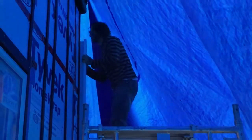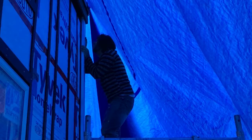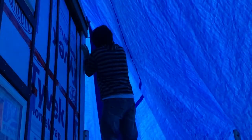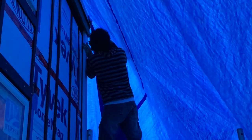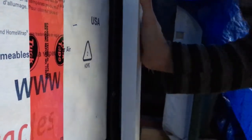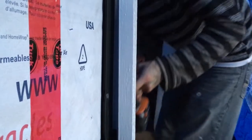Attaching the trim after it was painted wasn't too much of a challenge. We slipped the corner under the fascia and started by screwing in the top. The bottom took some force to get the bent boards to cooperate. The corners stick out about a half inch below the trailer flange, which is the same as the siding.